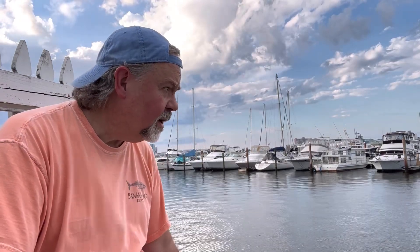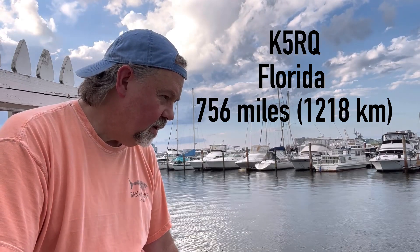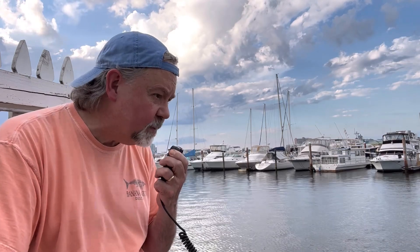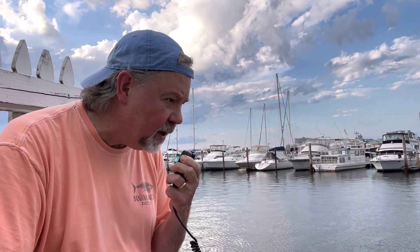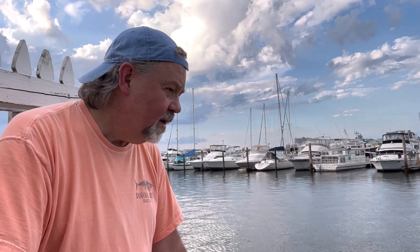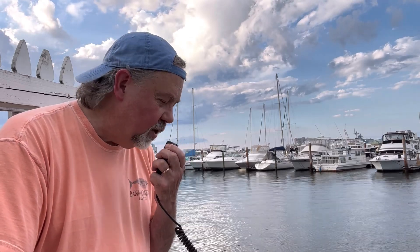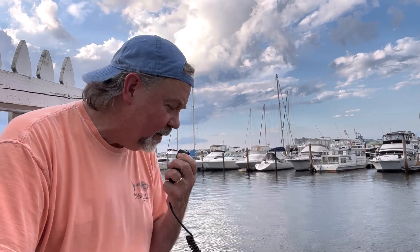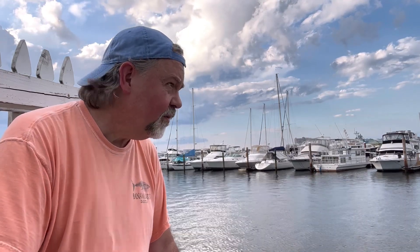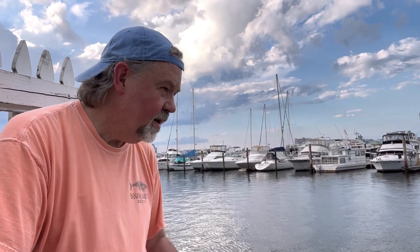Kilo 4 Oscar Golf Oscar. Kilo 4 Oscar Golf Oscar, thank you for the call. Nice to see you again Walt, my name is Dave, West Coast of Florida. Hey, roger roger Dave. I'm portable, 20 watts, with just a speaker wire in the air — a quarter wave length of speaker wire up in the air, portable down on the harbor here in Norfolk, Virginia. Good to hear that, thank you. You're 5-9 — you sound like you're next door, really good strong signal here tonight. Yeah, really good. It's interesting propagation tonight — some short skip, several hundred miles away, then about 800 miles, and then over into Europe too, so everything is good.